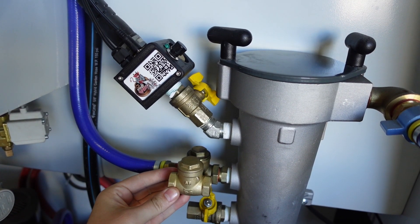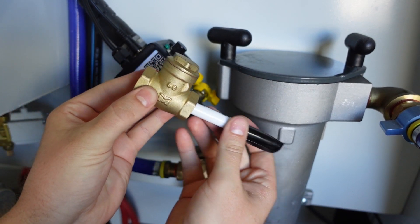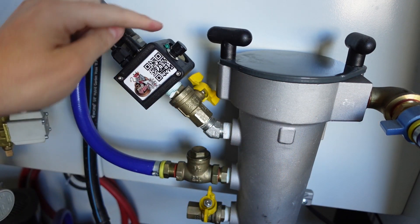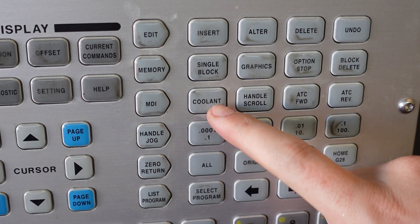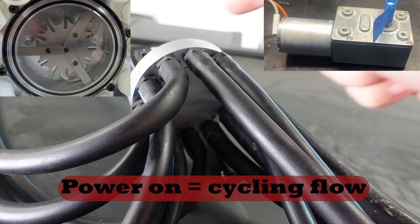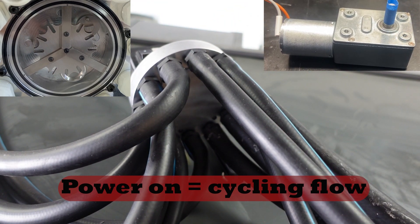Here's where the coolant enters the system. These are backflow prevention fittings. We only modify it by adding a magnet and then a reed switch, which measures whether coolant is flowing or not. When the coolant is flowing, that determines if our system is on or off — and that gives our 12-volt geared DC motor power.